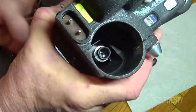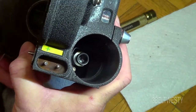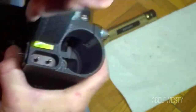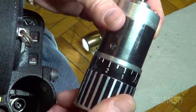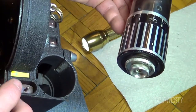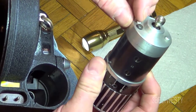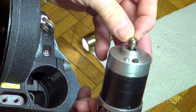With sluggish action, your coupler in there is going to elongate and rot out to where it's not being driven by the motor. The motor here has arbitrary numbers — this is actually a rheostat. When you've got voltage hooked up here, connected to the motor, you can just hook it up to ground and say six to ten volts and spin this around, and it will vary the speed.